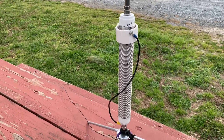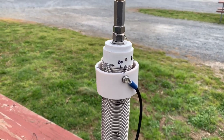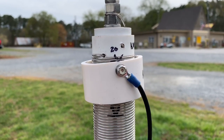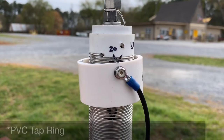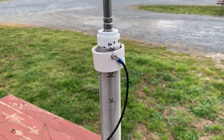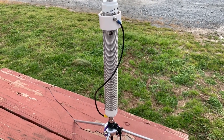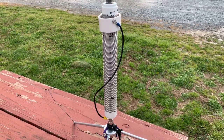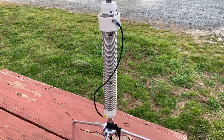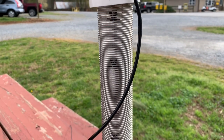The first thing is the coil does not come marked for particular bands. It gives you an idea when you start that you want to have a couple of the coil wraps exposed right at the top of the outer ring of the PVC. I've gone out with an antenna analyzer — and you do want to use an antenna analyzer — taken some measurements, and marked the coil with a Sharpie at each of the band settings so I can come back to that every time.